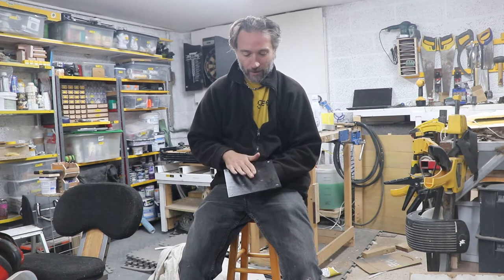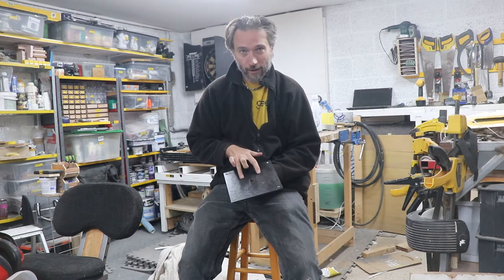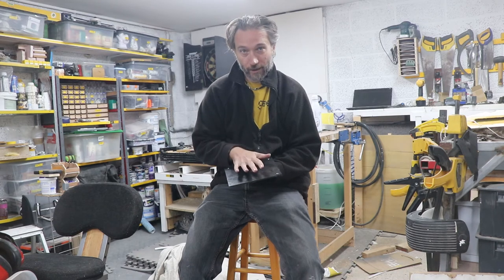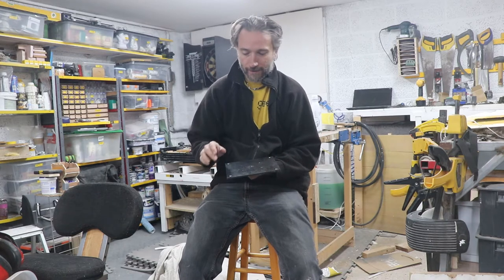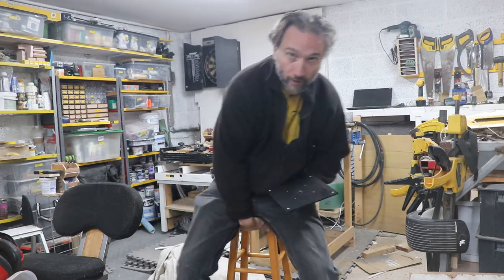This is probably overkill, but this is going to be the base plate for the whole structure. We have a hole in the middle for the pivot pin that will ultimately be welded into this. I have four tapped threaded holes which will hold the 3D printed cog onto this — that will ultimately be the rotation axis — and another four holes to screw it to.